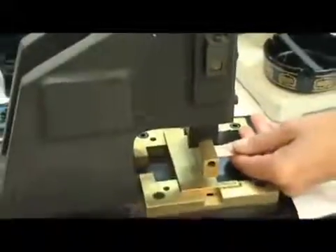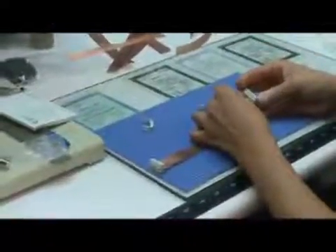Now you can see when we install the second connector more clearly exactly how this works. Again, you're going to take the ribbon cable, which is very, very flexible, and you're not going to try to put the connector on the end. You're going to slide the connector two or three or four inches down the cable.